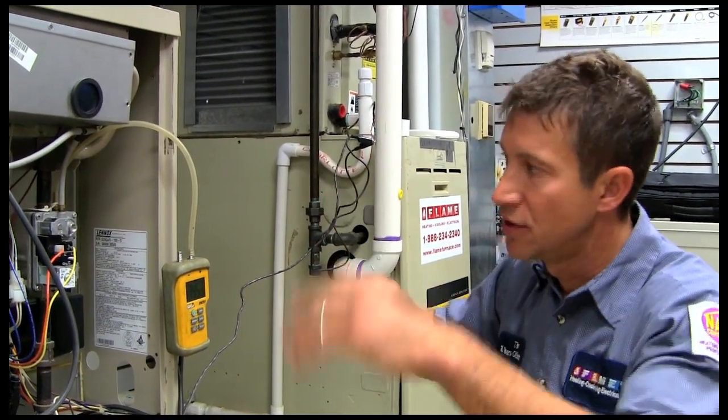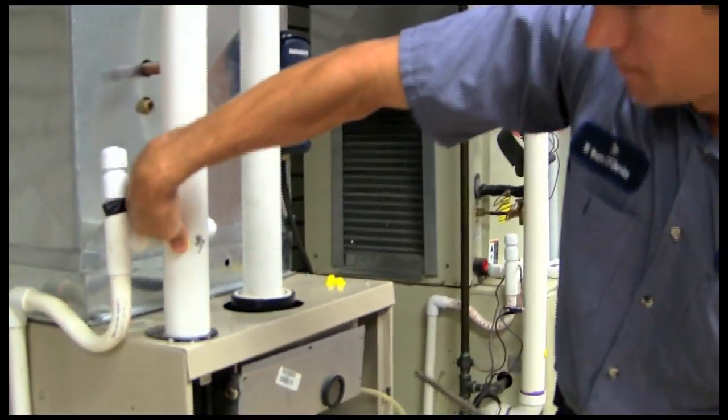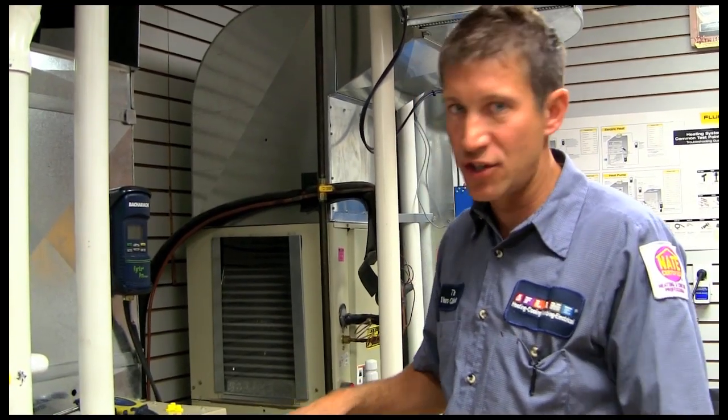As long as you're within range and your combustion is clean and adjusted correctly, that's it. Turn everything off, take your meter off, put your plugs back in, plug your exhaust hole back up. Now you know the furnace is running clean and safe within range. That way you get the longest lifespan out of it and the heat exchanger takes the least amount of wear.